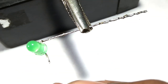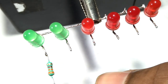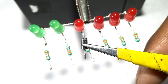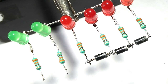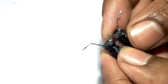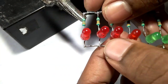I connect all LED negative legs together one by one, and then I connect the 330 ohm resistance to the positive legs. Then I connect the diode — you can do it according to my work. Then one capacitor negative and one capacitor positive pin connected together. You can see what I do.